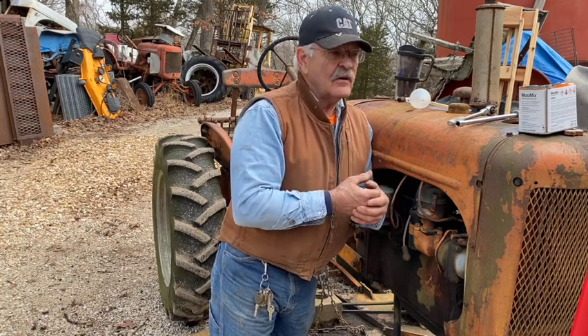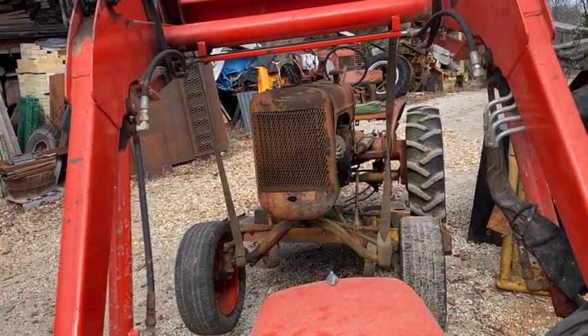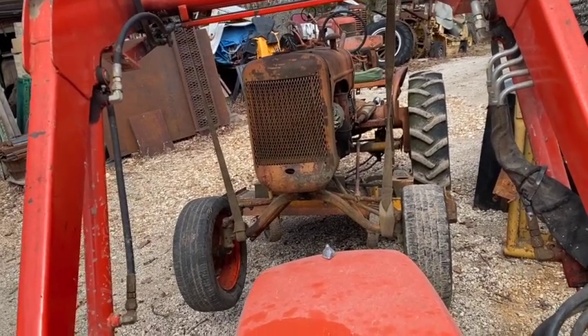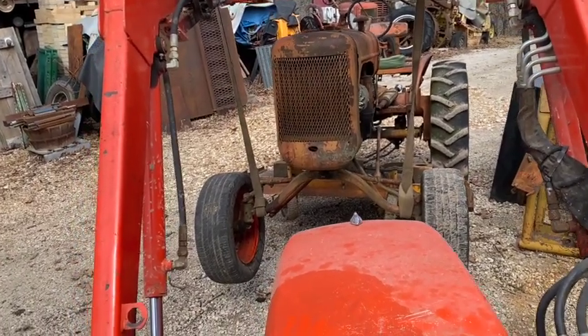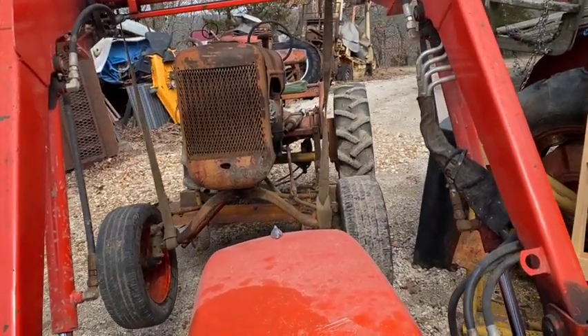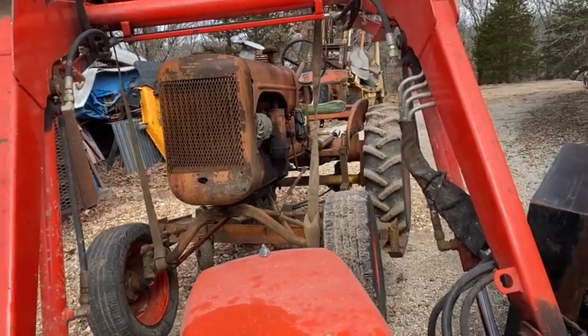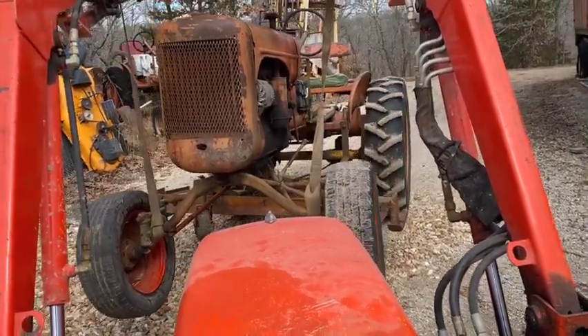It bothers me because I've got so many other tractors sitting around with buckets on them, and I don't seem to have any issue with those. Now that my older brother is gone, this is how we have to move stuff by ourselves. You have to be pretty careful to make sure you don't do any damage. A lot of times you need a spreader bar between the chokers above the hood so you don't risk collapsing any sheet metal.